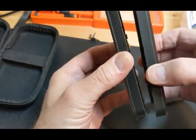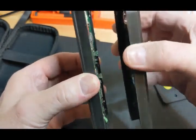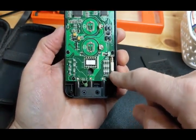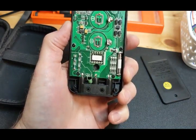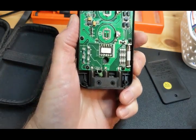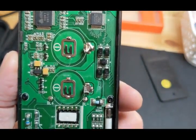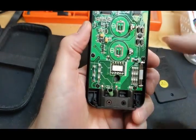Part of the protection of a multimeter is how the halves fit together — this has tongue and groove and it fits all the way down inside, about half an inch deep. That's good. There's a 600 milliamp fuse — it says it right there. Fuses in multimeters should ideally be matched to the voltage rating, but this one isn't a 600-volt fuse. There is a diode bridge here with what look like M7 diodes — four surrounding a center one — a really good diode bridge. There's an even bigger one in here too.